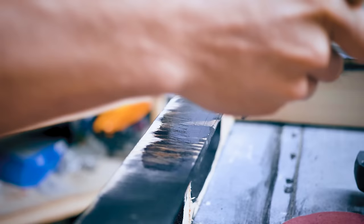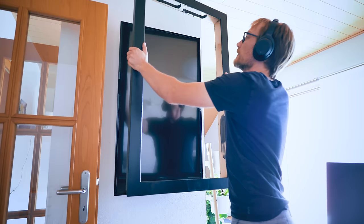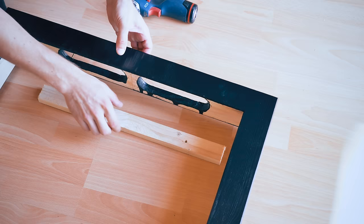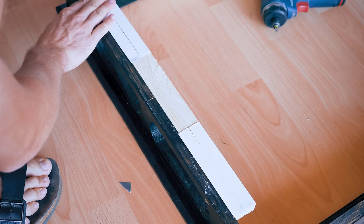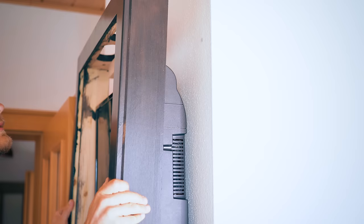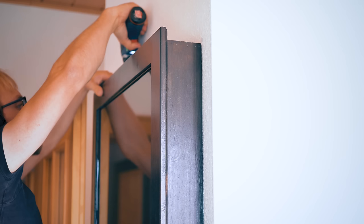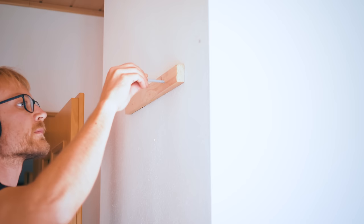You can still see where it got joined back together if you know what you're looking for, but if you don't, you can't really tell. For mounting the frame, I used pieces of what you'd call 1x2 in the US, commonly known as Dachlatten here. To align the frame to the screen, I used some double-sided tape to temporarily stick down the slat, then unscrewed the frame and anchored just the slat down in that position — worked really well. And of course, you can always fine-tune the position with a hammer.